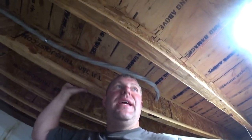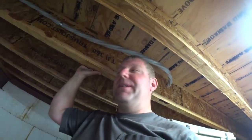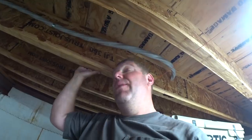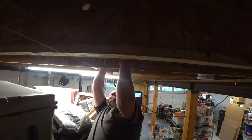Well, that's one side down, and I'd really like to get this side complete this evening before I call it a night. This side's a little bit different, though, because we don't have any switch wires that we're pulling through here, but we are going to have home runs for power, and that's how we're going to end up using up all the three holes. So I'm going to work on this for a little while, and we'll see how far we can get.